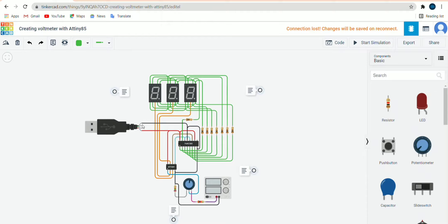For the USB cable, 5 volts goes to the power of the 8-bit shift register and ground goes to the output enable of the shift register. For the shift register connections: power goes to shift register clear, output 1 goes to segment A of the 7-segment display (third one) with a resistance of 100 ohm, input is connected to the output register clock, and output enable goes to ground.